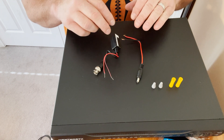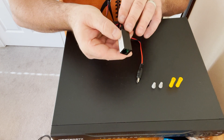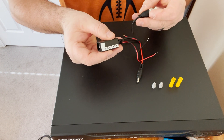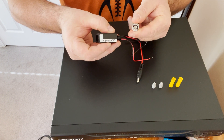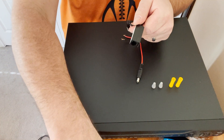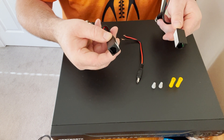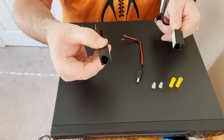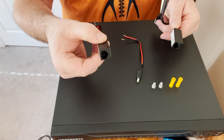This is a video balun — what you would use to convert Ethernet cable to a camera designed for RG59 or RG6 BNC coaxial cable. These are the same and they come in packages of two. One will go on the recorder end where the recorder and the power supply is, and the other video balun will go on the camera end and plug into the camera.